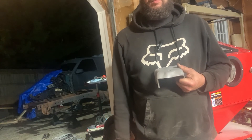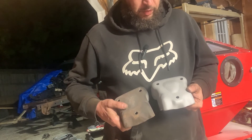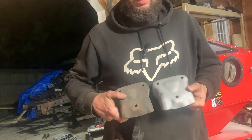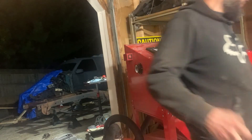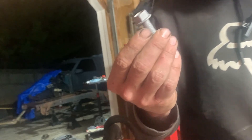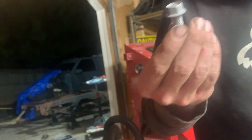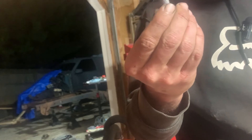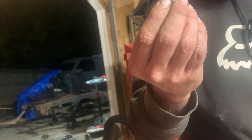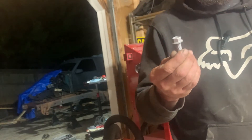Just get them clean, then blow them dry with compressed air and never touch them with your bare hands after you sandblast them. Here's the sandblasted one and here's the old one — pretty drastic difference. And here's the bolt — you remember what it looked like before, pretty rough looking. It looks like a pretty much brand new bolt now. This bolt is probably 27 or 28 years old, so I'd say that's pretty darn good.